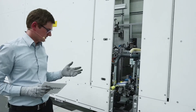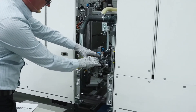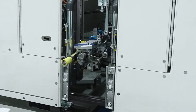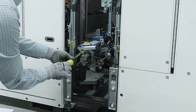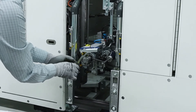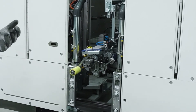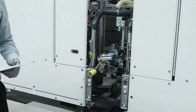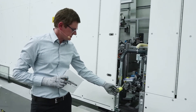Let's have a more detailed look at this corner refiner. Here we have a pneumatic cylinder, and from the linear motion generated we create a rotational or swiveling force for the roller. It is very easy to remove the roller without any tools or screws — all you have to do is just take the roller away. For the series we will add some mechanical clamps, but it will still be very easy to take the roller away without any tools or screws. The roller material itself has exactly the right properties of thickness, softness, and cut resistance.